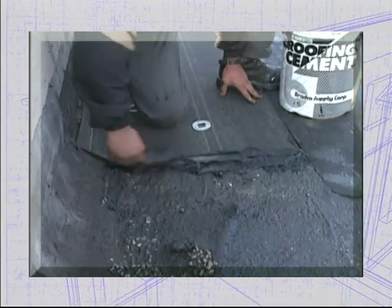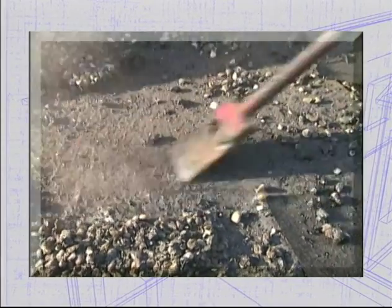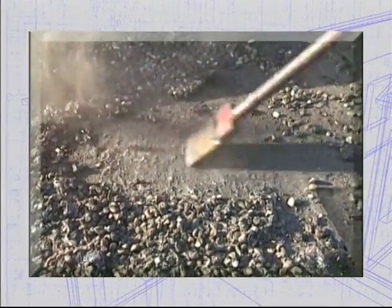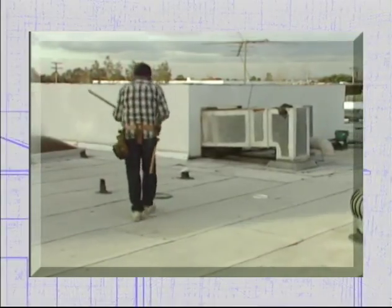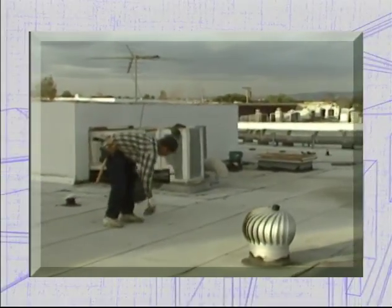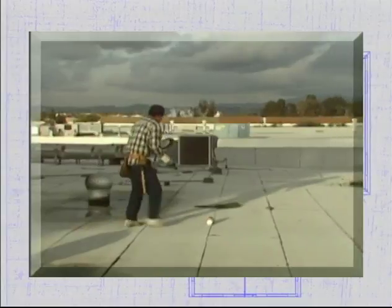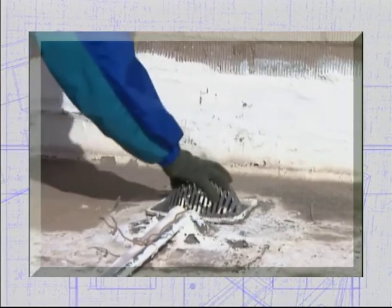Provide a watertight tie-off by cleaning the old membrane surface, or spudding an old aggregate surface smooth. Use spud bars or a power scratcher for this task. And finally, before you leave, carefully check over the new membrane, whether it's temporary or a finished product, to assure it will stay watertight until you return to finish the job. Remove any loose debris to prevent blocking of the drains, and check that all drains are clear one more time.